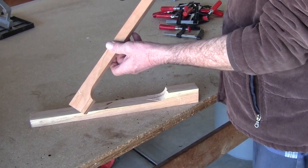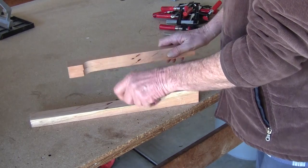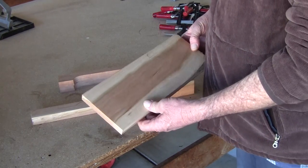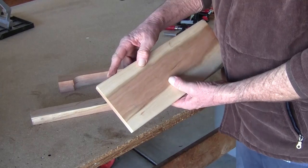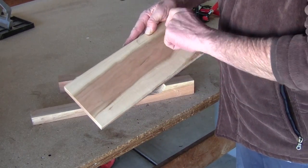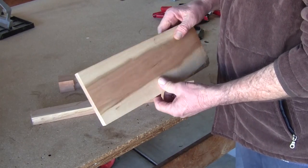I need a little extension, maybe three or four inches, to put the shade on. So what we're going to do — I'm going to go ahead and take this piece, surface both sides, then send one side through the jointer. Then I'm going to square it off on the table saw to make sure it's the same thickness, then join this side.